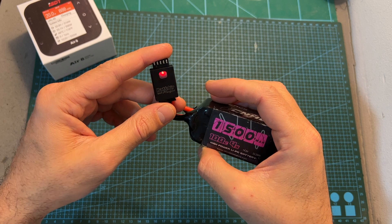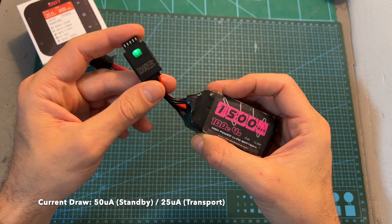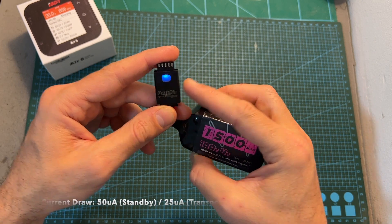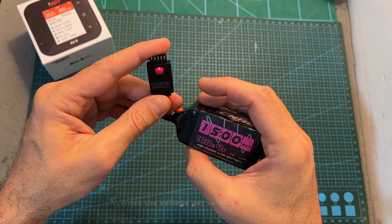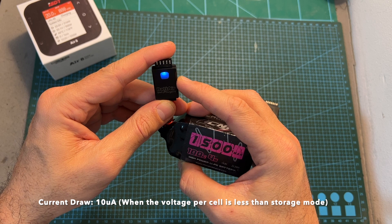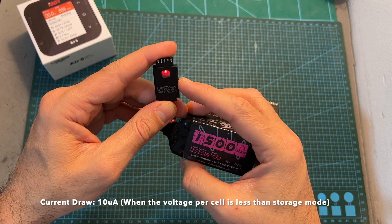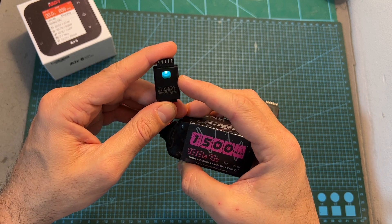In addition, in case you are worried that the battery plug-in is going to deplete your battery when it is not in use, you should not worry, as its power consumption is very low. When the voltage per cell drops below the storage voltage configured in the battery application, it will enter a very low-level mode which is not even going to make the battery plug-in recognizable by the battery app.